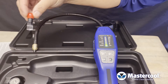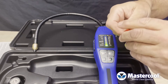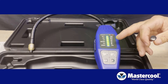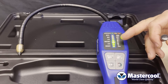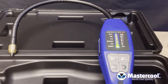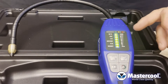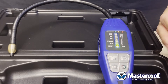All the units come with a leak vial. This is for demonstrating the electronic leak detector. All you're going to do is take the cap off — there's some residual gas in there. Take it to the tip and you're going to see the unit go off. Now that's a rather large leak because all of the LEDs became illuminated. The interference light is up and it's just going to clear itself, which usually takes a couple seconds. Once the ready light is illuminated and it's beeping, it's ready to find a leak. Just take the cap to the tip, the unit will go off, tells you how large the leak is, and then it clears. Once it starts beeping again, it's ready to look for another leak.